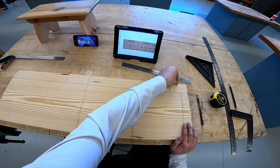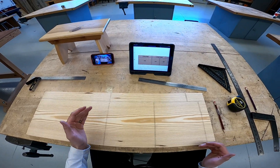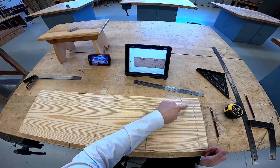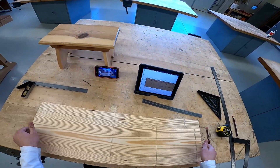We're going to make a small cut right on the edge just to make sure our board is 11 and 1/8 inches wide. It might already be that, so we might not actually cut anything — that's okay. Our second cut is going to be nine, which is going to make the rip cut on the double lines that we drew.